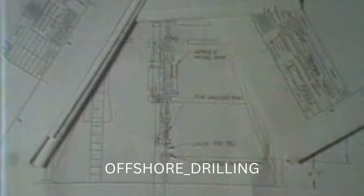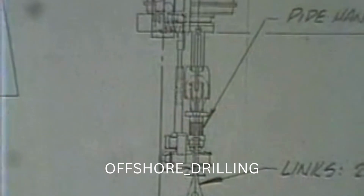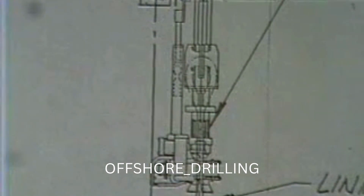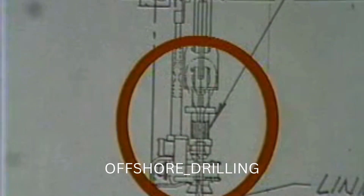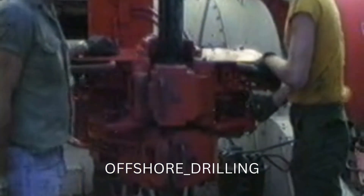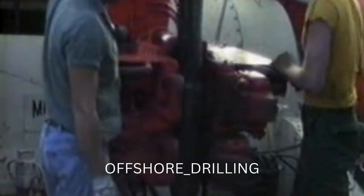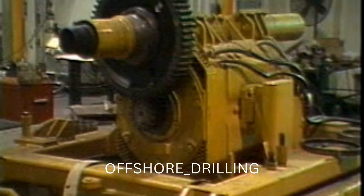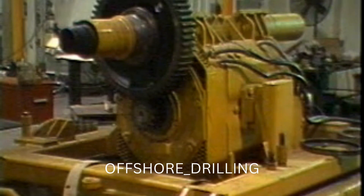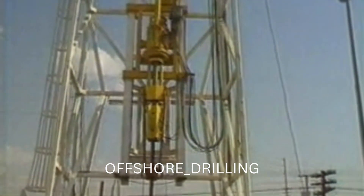Development of this drilling system began several years ago when, after considerable investigation, Varco determined that the key to a successful derrick-mounted drilling system would be found in the method of making and breaking connections overhead in the derrick. At that time, the technology did not exist to reliably handle this operation, but several years later, with Varco's hydraulic pipe handling tools proven successful, a second look was given the problem of breaking connections in the derrick. Initial designs utilized a railway traction motor mounted in the derrick, rotating the string through a locomotive reduction gear and a hollow shaft, replacing the axle and flanged wheels. The success of this design proved the concept and development continued to progress.